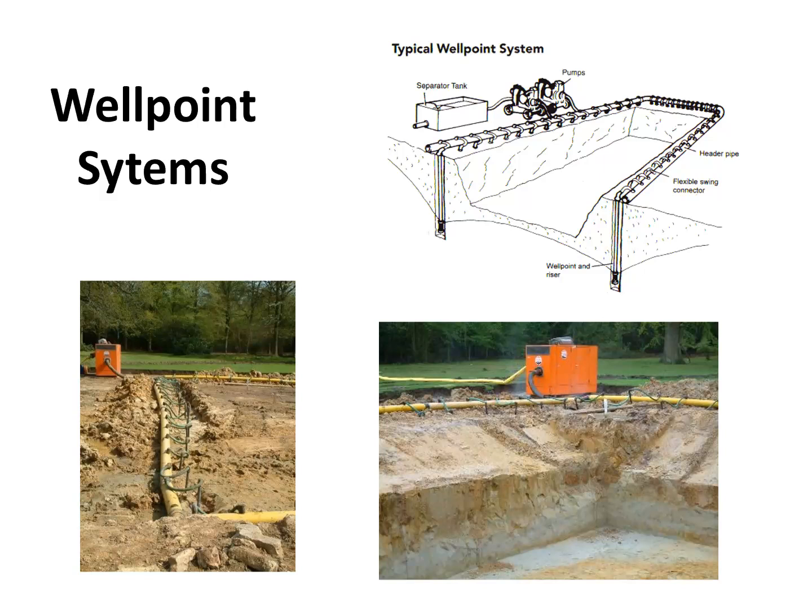Presumably, you construct a foundation or a waterproof basement in there, and then you can let the water come back. In a lot of regions where you have a high water table, traditionally it was customary that you create a concrete floor and concrete walls, and you could even put a tar or other things on it to try to waterproof it. But if you do get a leak, often they'll put in some kind of sump and pump that out. Another thing that's becoming really common these days is an additive that you can put in the concrete, such that when the concrete cracks and it fills with water, that additive swells and it seals itself. So it makes for extremely waterproof foundations.